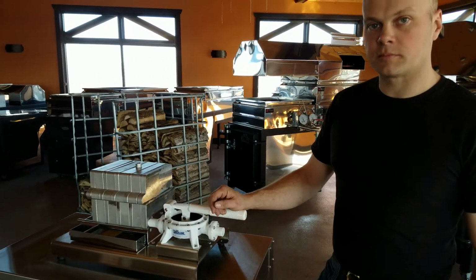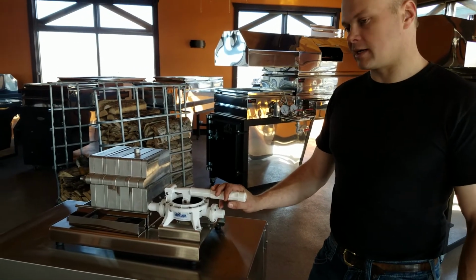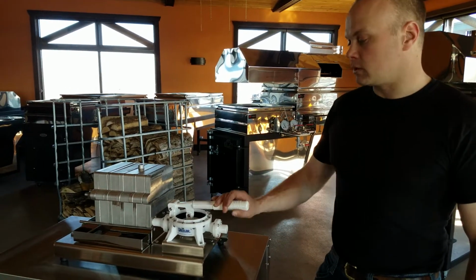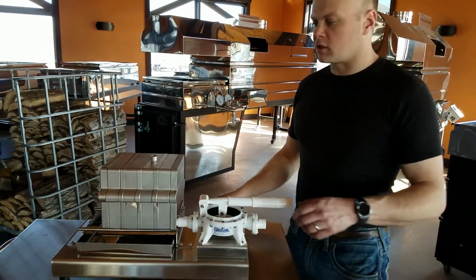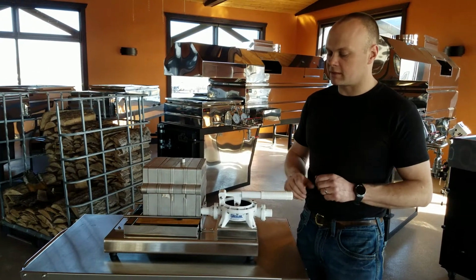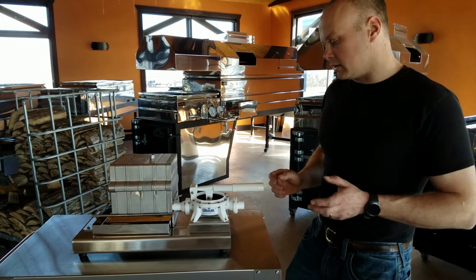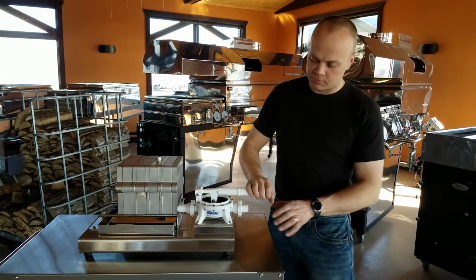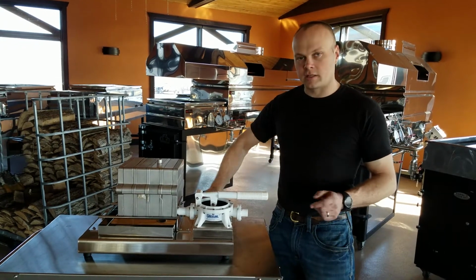It's an American-made pump. Very high quality pump, but one issue that we frequently see, it's not a very common issue, but with the amount of filter presses we've sent out, it is a frequent thing that we run into, where when someone is pumping very hard, meaning at the end of the cycle when they are pretty well clogged up, they've reached the capacity of the filter press, but they want to get a little bit more syrup through, they'll push very, very hard on this pump, and then occasionally they will get backflow. All of a sudden the handle will go down really easy and syrup will go shooting back down into the container that they're trying to pump out of. And I'll show you why that happens, if that happens to you.